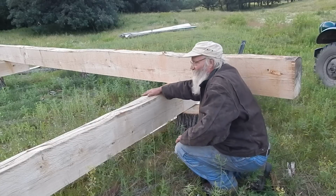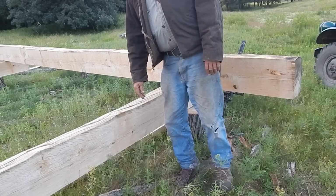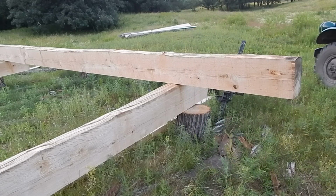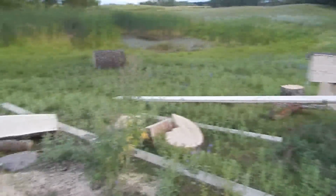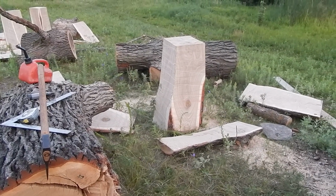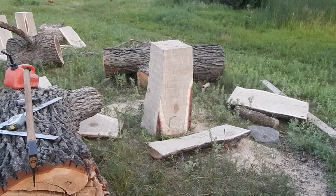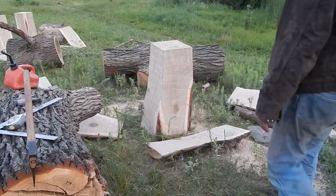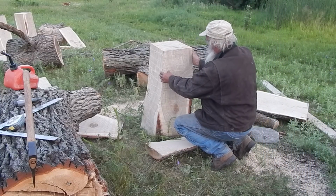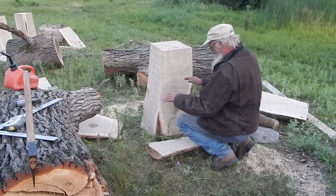But I thought I'd explain that before I get much further into this, but I've been cutting them. And I've got a few of them spread around here, but that's what they look like now. I'll scrape off the extra bark, and I've cut them kind of. What I've done is I've made a foot square on top, because that's what matters, for the first 6 inches. But then I've actually flared them out a little bit to get an even bigger base.